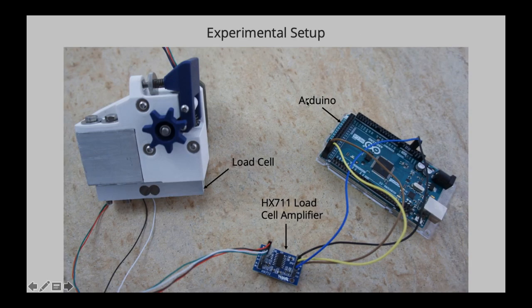The experimental setup is actually quite straightforward. We want to measure a weight or a force, and from your household appliances, you know a certain household appliance that can do that. That's your scale, and that's what we're going to use here as well. A scale has a load cell in it, and this load cell is attached to this experimental setup, which tries to remodel the distance between these hob gears and this nozzle tip. So the distance between these hob gears and this load cell is exactly the same distance as you would have between the hob gears and the nozzle of an OmniaDrop extruder.